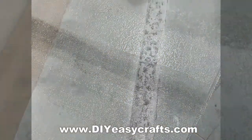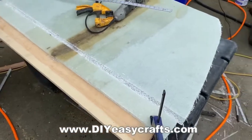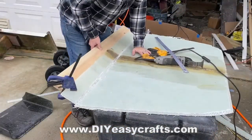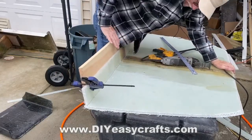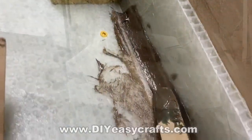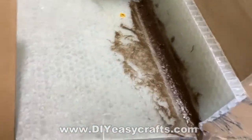The last thing I want to show you — fiberglass does not flow well over a right-angle edge. So if you cut a wider groove, you can actually bend the glass right into that groove, or you could cut a 45 and bend it into the 45. You're going to have to hold this into position with a jig, then run some fiberglass putty and then run some glass. I'm puttying with that popsicle stick paint stirrer, and then I would run some glass right up along both of those panels to hold it in position.